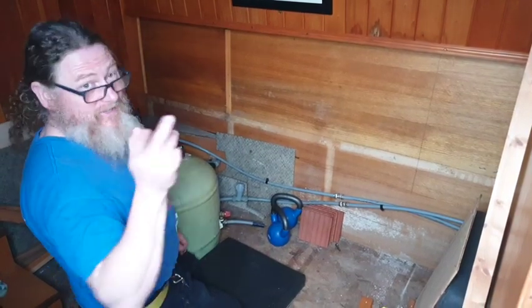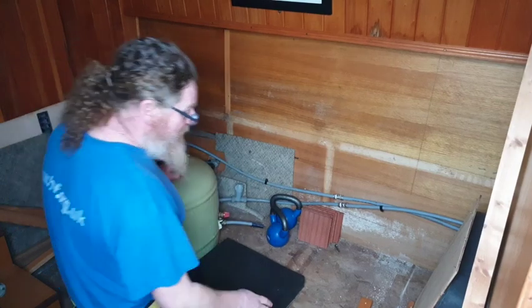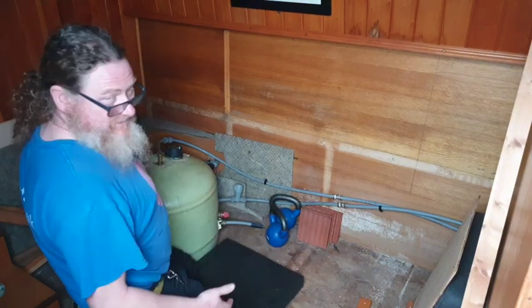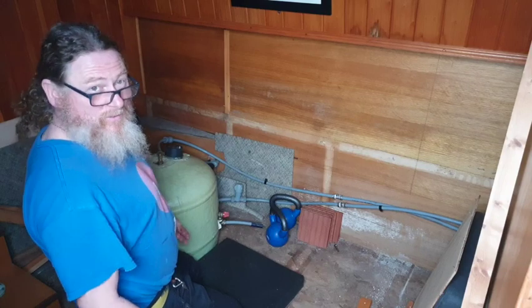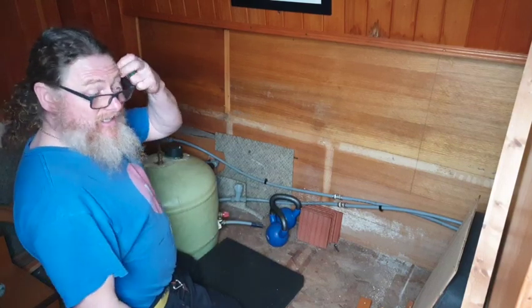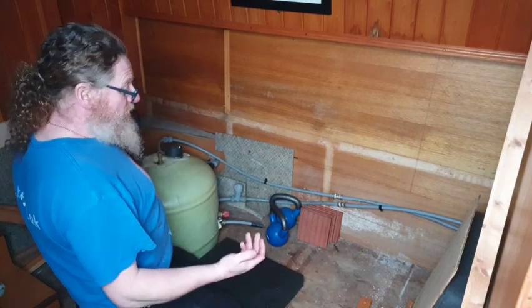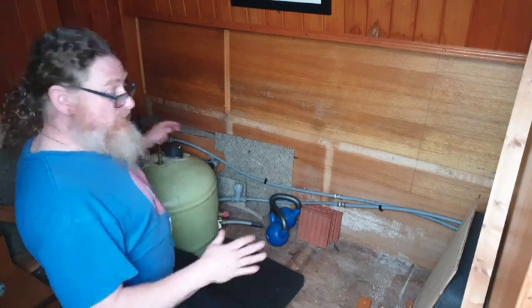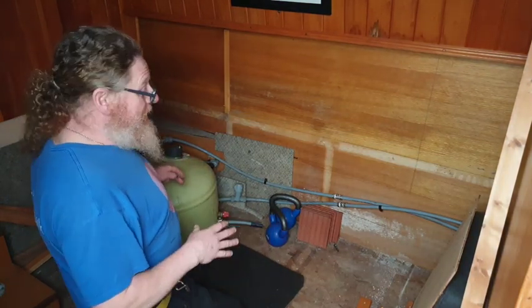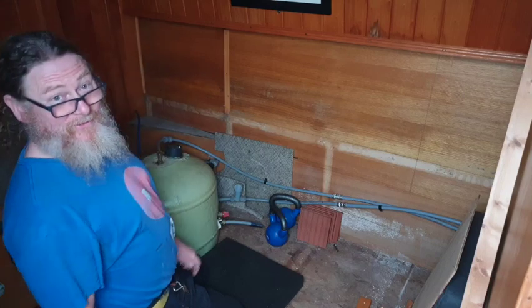But yeah, another thing I've got to do as well, which I will be doing, not quite this time, I don't think I'll have time this weekend, is taking up this floor so I can take ballast out, because we were overplated, so we're a bit heavy, and we're about 2 inches too low in the water. So I want to take that out and rebalance the boat properly. I also want to get rid of the flags, because the concrete flags actually absorb moisture, hold moisture within them. And I'm going to change them for engineering bricks, which means I can move ballast a lot better. So once we get everything in and finished, I can move ballast around in the back, take it out, put some more in, whatever I need, and have the boat perfectly balanced for while we're actually floating, or barely floating.